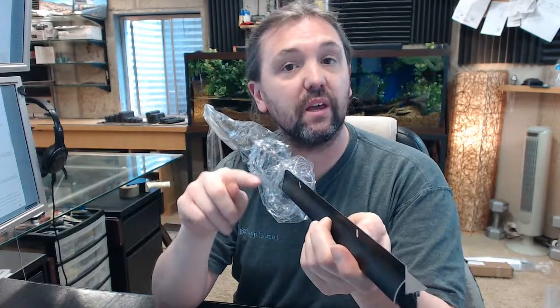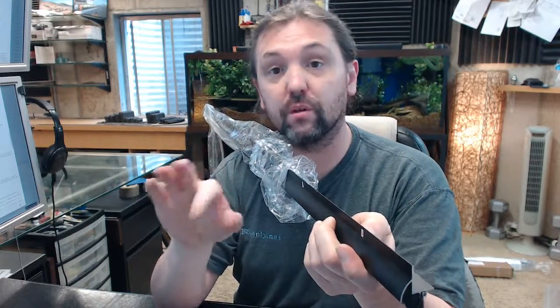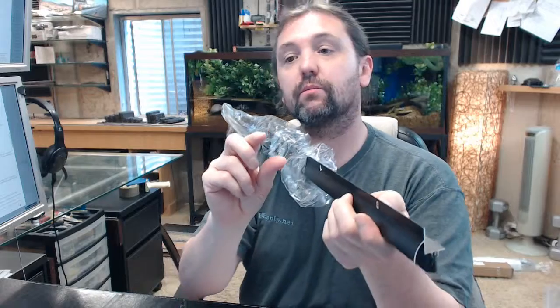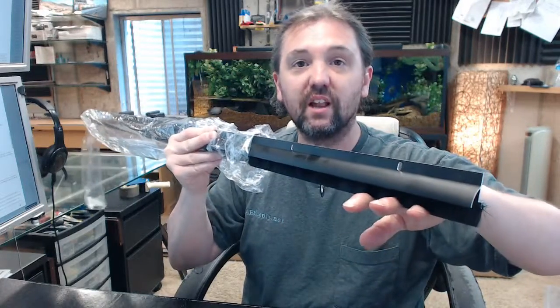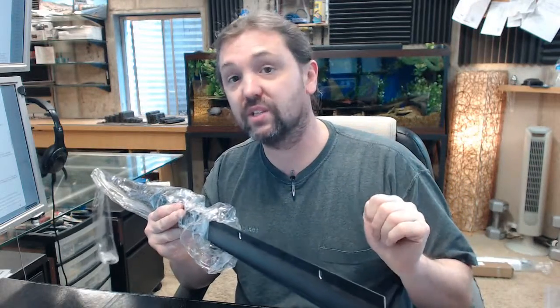People in the restaurant business like nylon bristle compared to neoprene, silicone, or vinyl, because the inspector is looking for daylight. If they can see daylight, critters can get in — that's the logic. Bristle really knocks the daylight down, and that's why people like it: if you can't see daylight, you know you've got a positive seal there.